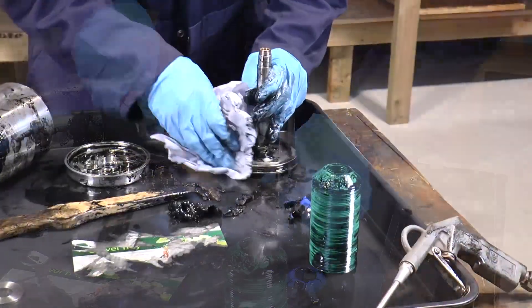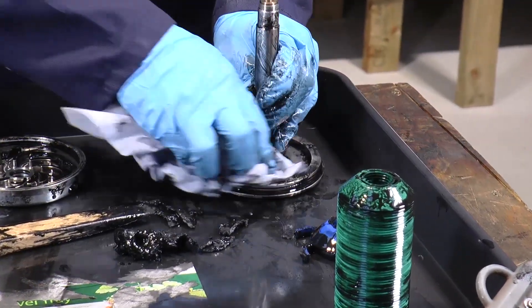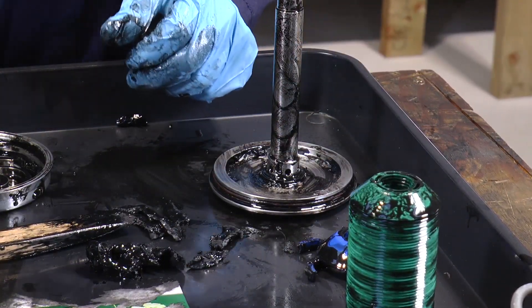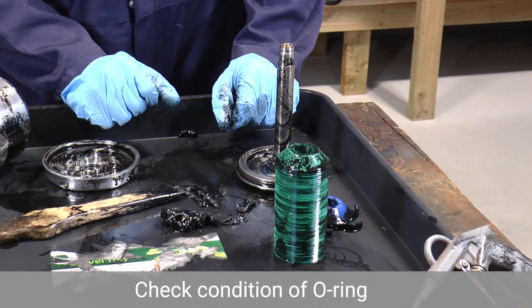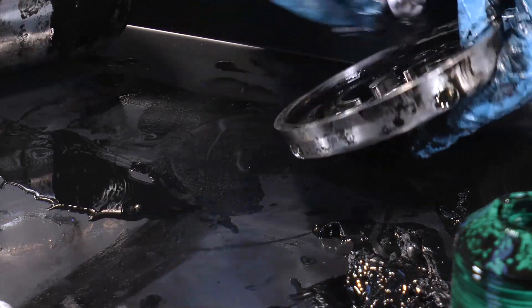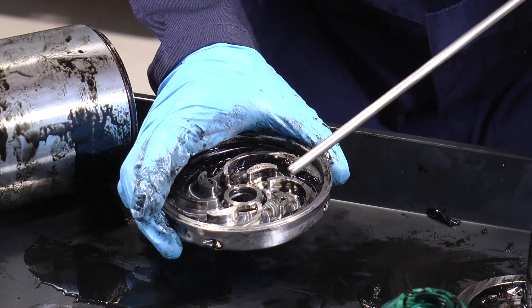We can now wipe with a clean cloth — if need be, a little bit of lubricant or clean oil just to help the process. There's no need to clean individually the bowl discs and they don't even need to be removed unless the sludge has gone under the distributor impeller or into the discs themselves. We now need to clean the top turbine, give a wipe round. One very important factor is to check that the nozzles aren't blocked. One of the best ways to ensure these are clean is by using a source of compressed air.